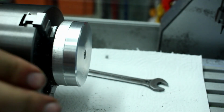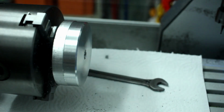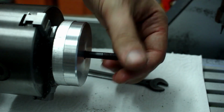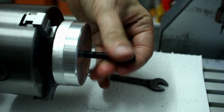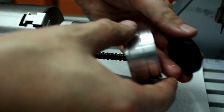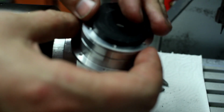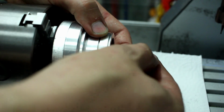This is all a little bit hard because it's facing away from me, from the operating side, which doesn't exactly help with visibility. So we get the stud here back in place. Drop our part in here. Here's a large plastic washer that goes into this stepped area of the part, like this. This goes on here, and we add a steel washer just to distribute the load.